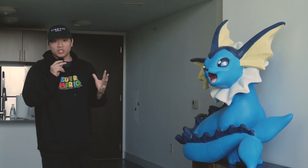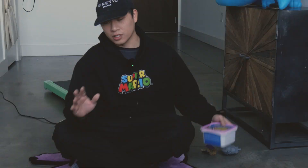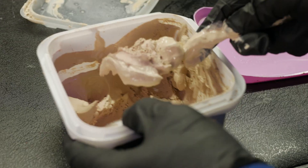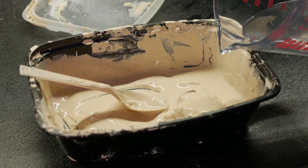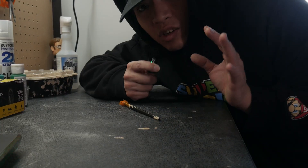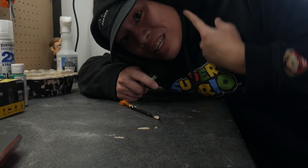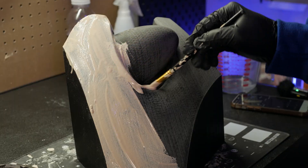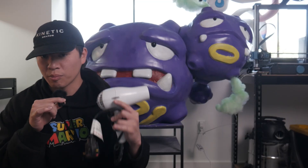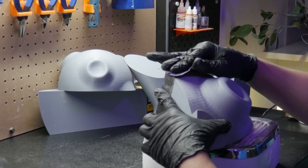Actually, what you want to do is get started right away. Get your 80 grit sandpaper and start sanding the piece. The next thing you want to do is use putty — mix putty with water or acetone until it's thick but not too thick. Grab a brush, doesn't matter which one, and use that to brush the putty all over the piece. Then use a blow dryer to dry off the putty, or air dry it while you work on other pieces.